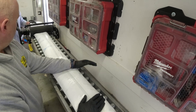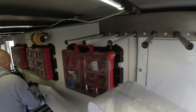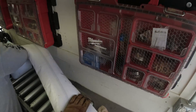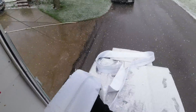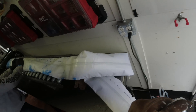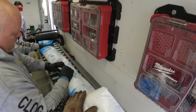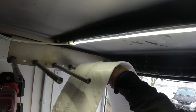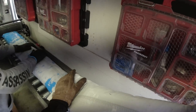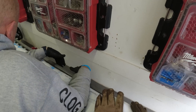I know about UV cure liners — maybe one day. So we have to basically massage the epoxy into this liner. Since it's so cold out, it's not going in by itself so well. We have the calibrated rollers at the end of this table, which helps press it in and get a set amount of epoxy throughout the whole length of the liner. You can even see it's snowing out there, of all things. This process took a very long time due to the cold weather.